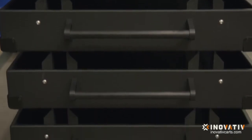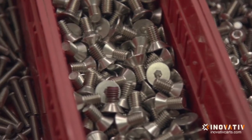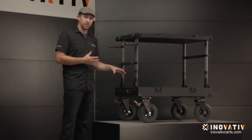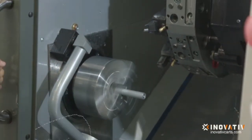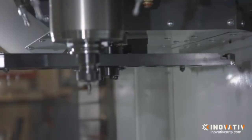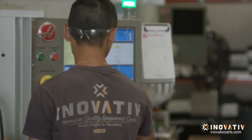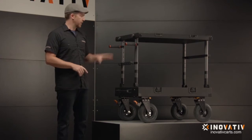The Scouts are manufactured using 5052 and 6061 aluminum. The components are stainless steel, and in fact some of the components on the Scout 37 and 42 — like the axle and the rod end — which are stainless steel, on the Scout 31 are aluminum. The reason for that is to drop or reduce the weight of the Scout 31 as much as possible to get it down to that 50-pound mark, which is one reason why the Scout 31's price tag is not that far south of the Scout 37. The Scout 37 weighs in at 65 pounds complete in this configuration, and the Scout 42 at 75 pounds.